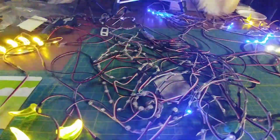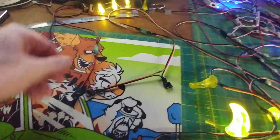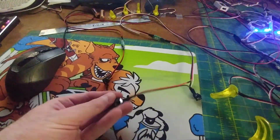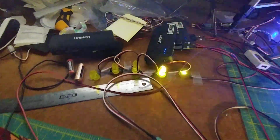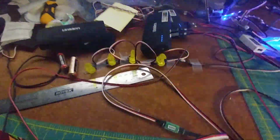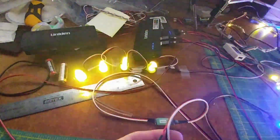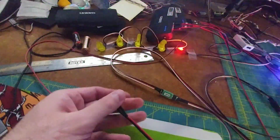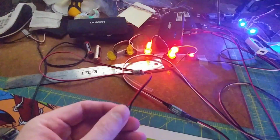And this particular suit will have 3 buttons. On one side there's 2 buttons, on the other side there's a third. So this will be on the right side. This will be situated on the back of your wrist, and this will be in your palm, right there. Same thing for the left button, it'll be on your left palm. How you control this suit: they happen to have claws that light up. So I use the claws as a temporary menu. When you hit the wrist button once, it'll turn on the menu, and it goes away after a second and a half. If you hit it again and hit a button, you can index your mode ahead any way you want. If you go past it, you can hit your left button and go backwards.